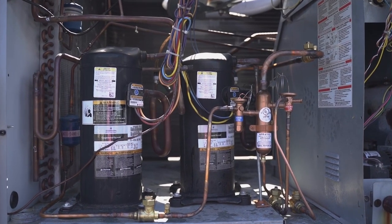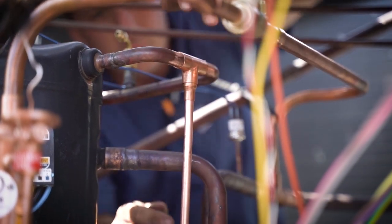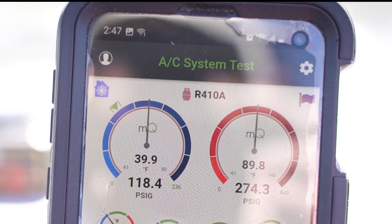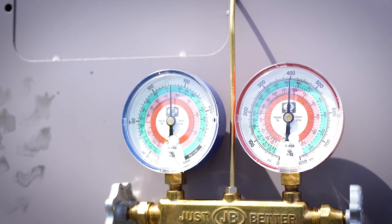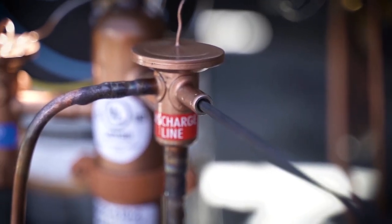And that's how we install an APR control on a rooftop unit. We do not cover all the details of the charging and evacuation procedures — these are common practices for seasoned technicians, and we believe a seasoned technician should be the one to install the APR control. The APR control is applicable to a variety of units and applications, so each installation can and will be different. The APR control's factory suction pressure set point is 118 pounds. In order to hear the APR control function, the suction pressure must be below the set point. If the suction pressure is above the set point, you will not hear the APR control function — this is perfectly normal, as the set point is set for low load conditions. If you feel the set point will not work in your situation, please check out our adjustment video to adjust your APR control to fit your needs.